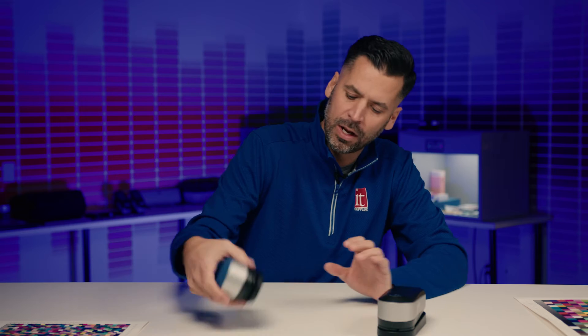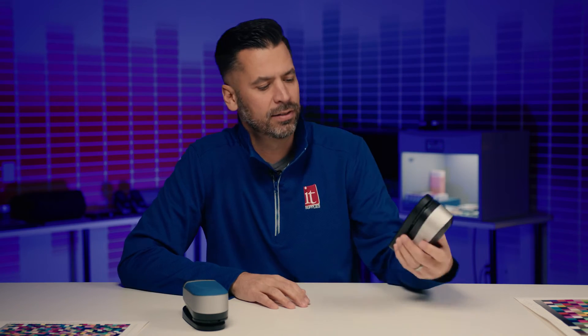One of the major differences between the Pro 3 and Pro 3 Plus is the aperture. The Pro 3 comes with a 4.5 millimeter aperture, as opposed to the Pro 3 Plus which has an 8 millimeter aperture. If you work in a printing environment that mostly prints on smooth surfaces, the Pro 3's 4.5 millimeter aperture will provide the accuracy you need. This includes papers, banners, vinyl, canvas, and most non-textured surfaces. The patch size for this device is 8 by 8 millimeters.